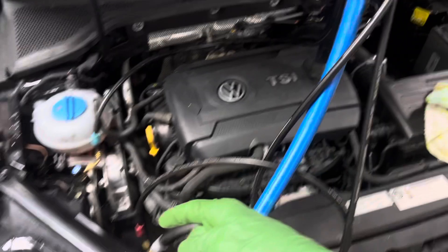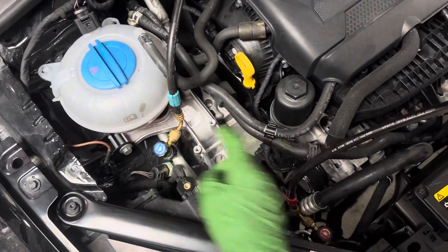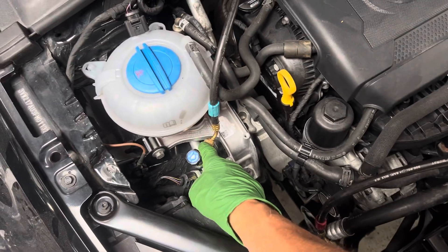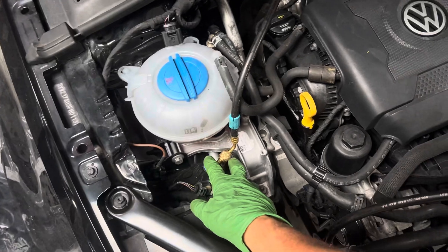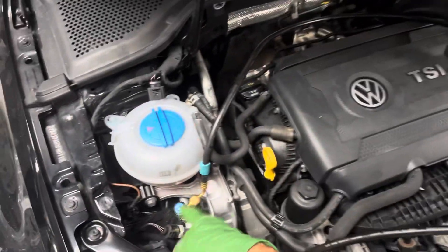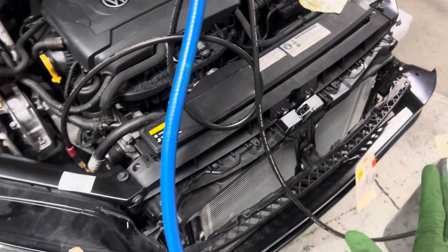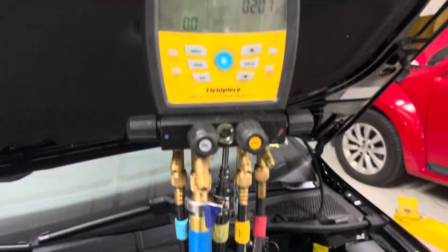Other than that, for the purge: I put nitrogen in the high side and bleed out the low side — I've made videos on this. Then I evacuate, purge more nitrogen up to zero, and do that about three times. I can't run this car, so remember this vehicle is unrunnable — I'm just going to fill it up. See you later.